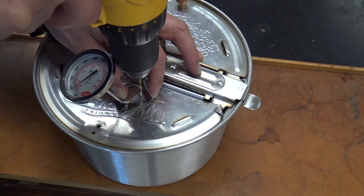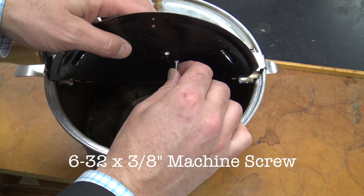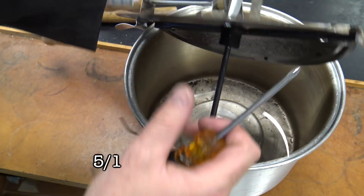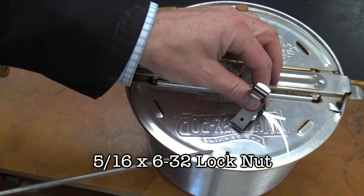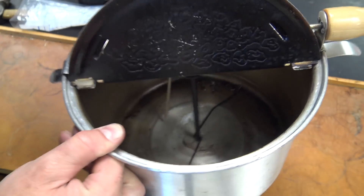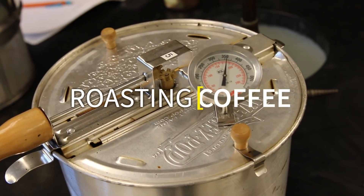Here's my quick modification: if you're going to use an analog temperature probe like this one, you're going to have to drill a few holes and get it attached in there nice and tight. I found the best way to do this is with machine screws and then a lock nut on the other side. You want the end of that thermometer to be within about a centimeter of the bottom so you get an accurate reading.